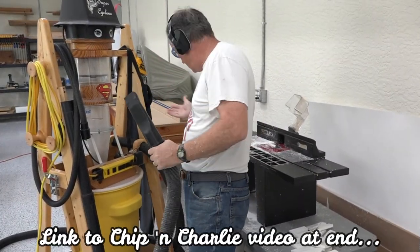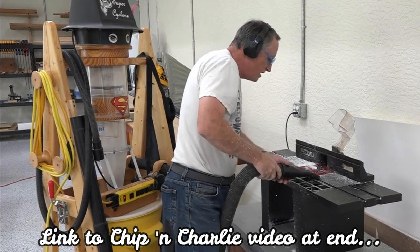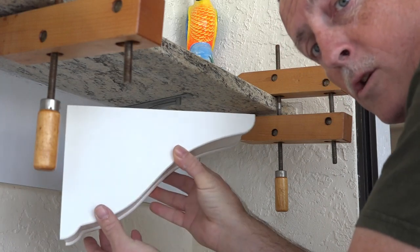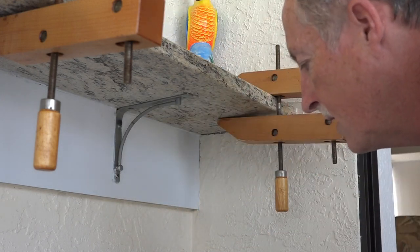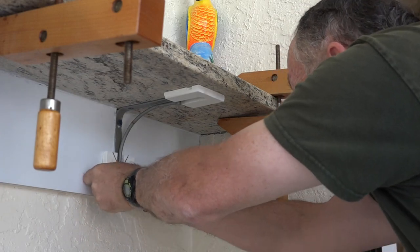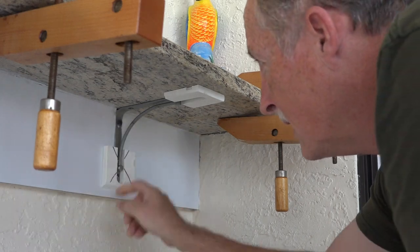Okay Chip, time for you to get to work — clean up this mess! Before I can attach these corbels, they've been cut to be perfect — it fits just inside there. The only way to hold them on is with these brackets I made. These will go like this and like this — they not only center it, but give me something to nail into on the sides. So I can staple with my staple gun and glue on this side.